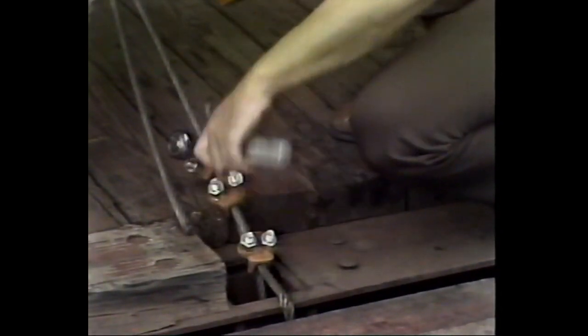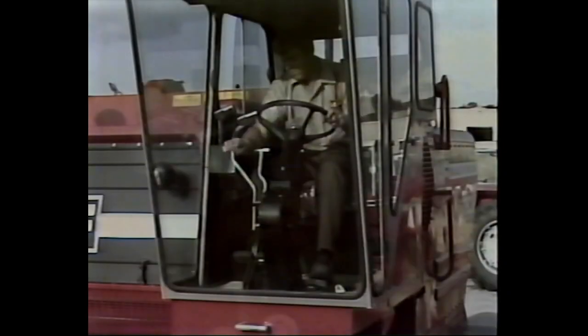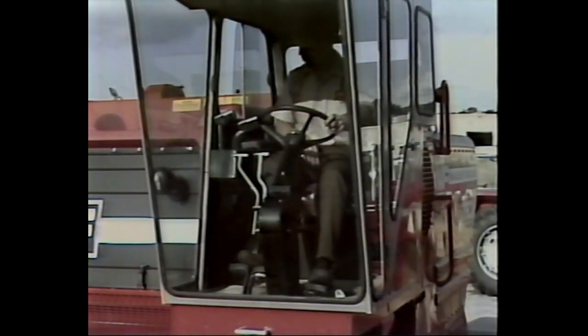To prevent damage to the combine and its accessories when unloading from a rail car or truck, it is important that certain procedures be followed. First, make sure that all hold downs have been removed and that all obstructions have been moved out of the way. Next, check all drive controls to make sure they move freely. If you encounter a problem, find and correct it before attempting to move the combine.